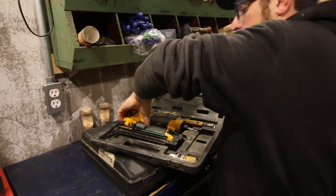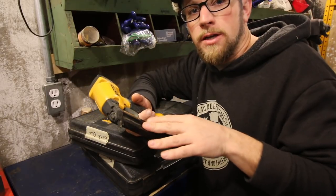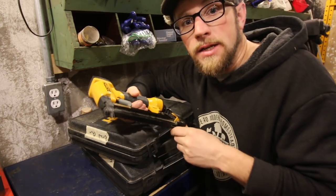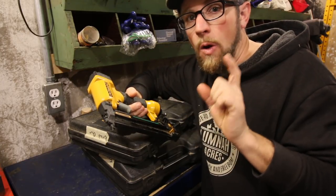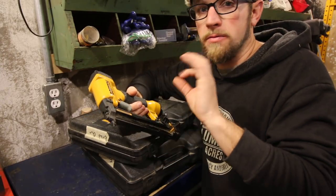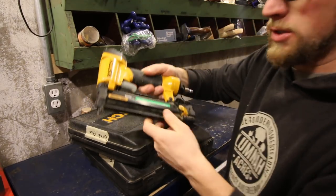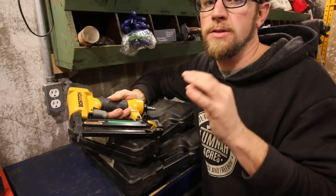Here in this case is a brad gun. This gun shoots a nice little finish nail — you can go as short as five-eighths of an inch and as long as inch and five-eighths. It's nice and small and can get into tight spots. The nice thing about this gun is it leaves behind only a pinhole from the nail. You don't have to worry about head marks like you'd get from a framing gun or siding gun — it's more finish work, which is nice.